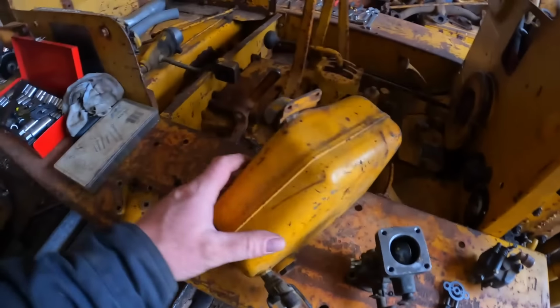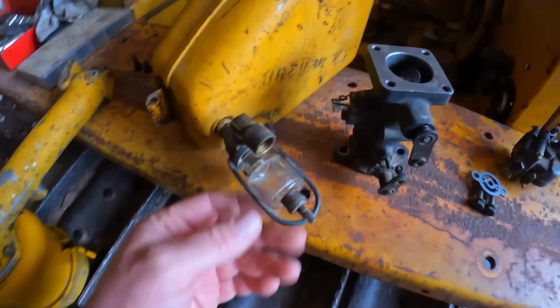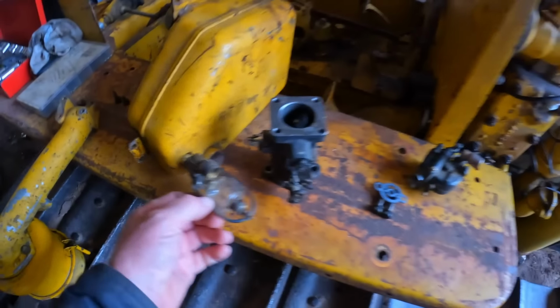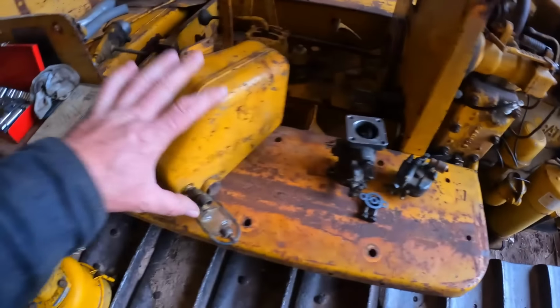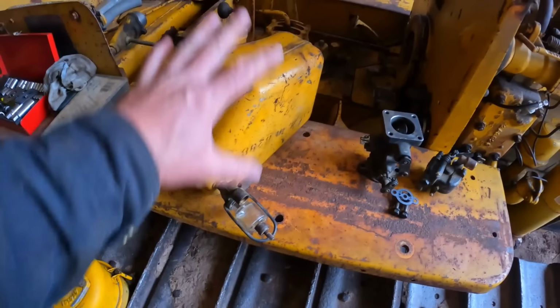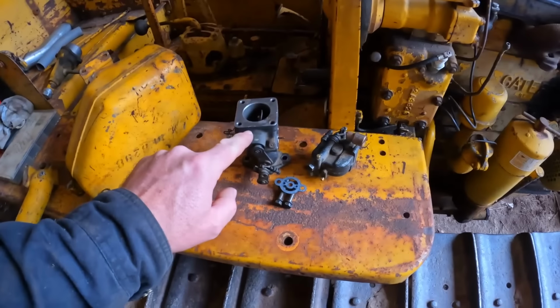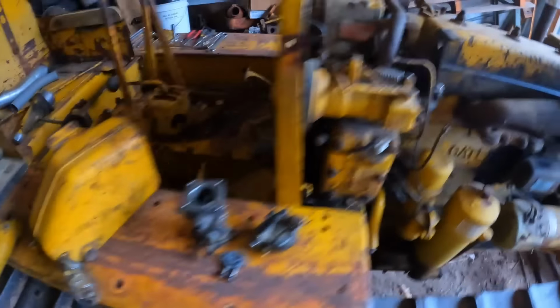Also, did a clean out on the pony fuel tank, just to be sure. Refurbed the sediment bowl, got a good stack of those edge filters up in there. That's just as important of a part of a carburetor rebuild, is making sure your tank is clean and that anything, crud, potential bad fuel, whatever, will be trapped there before it can get to there. Otherwise, all that work was for nothing. Got the pony air cleaner spruced up as well, so let's get it all put together.